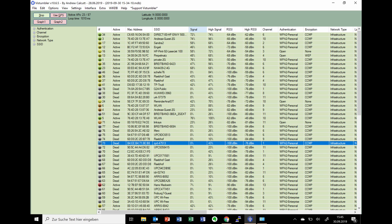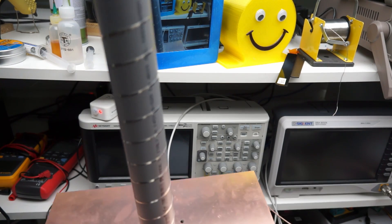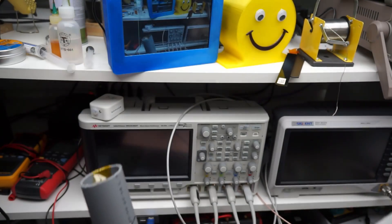You can also estimate the directionality of your antenna by watching the RSSI of a particular access point while turning your antenna. Really simple. Speaking of directional antennas, of course we want to have one — or better, a few of them to compare.